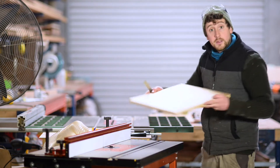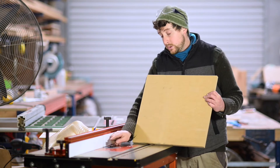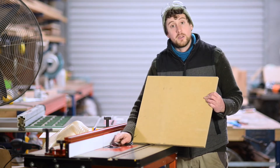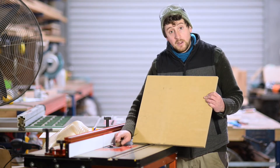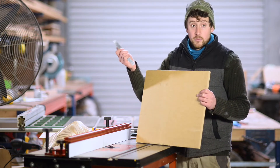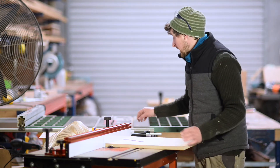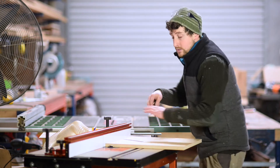In order to cut the really shallow channel on the underside for our miter slider, we just need to drop this right down so that it's only about 1.5mm above the surface of the table. You can check that by using a really fine ruler or something like that. Hold your piece up against it and measure that way so that you have a nice reference to look at.